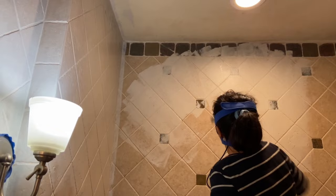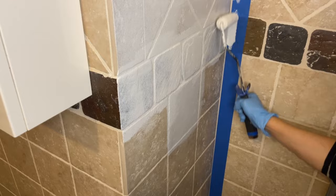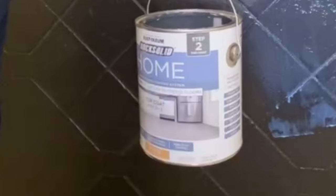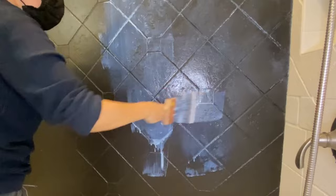After doing a deep cleaning, I painted the tiles with a primer. Once they were dry, I applied two coats of regular paint and a coat of top coat using the Rustoleum Two Steps Floor Coating System. All the materials are listed in the description of that original video and also I'll put them down below in this one.